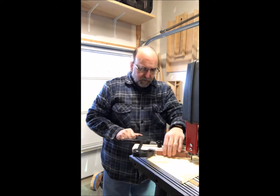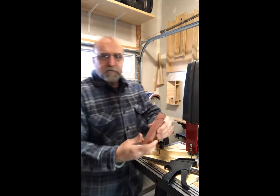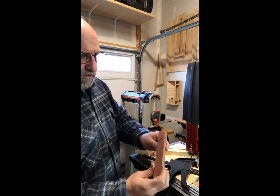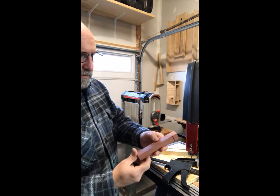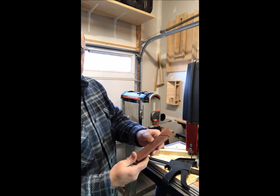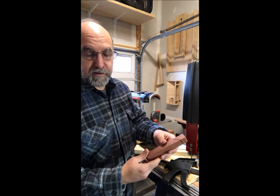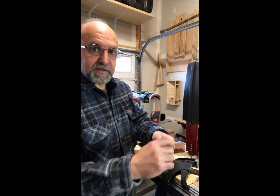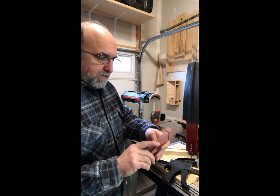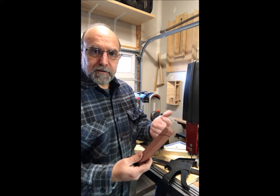So the way you do these, if you're not familiar with the Celtic knot technique, is you cut a kerf like this, and then you'll put a contrasting color thin piece of either wood. Sometimes I've heard of people using credit cards or gift cards, a little piece of plastic in their woodwork. If I'm using a light wood, I'll make a shop-made veneer like a walnut or something.